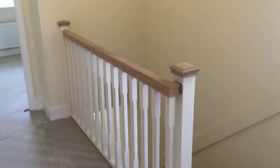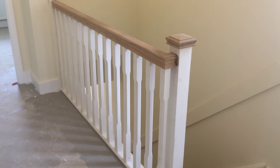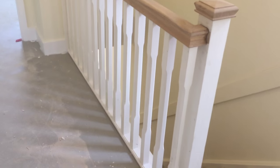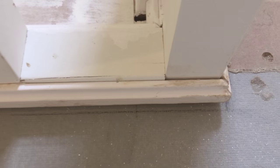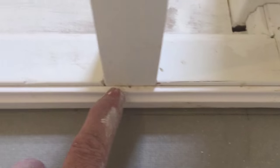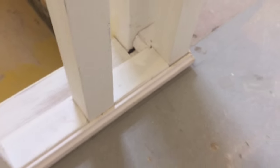Right guys, here's a typical stairs I've got to do — I've got to varnish that rail and undercoat and gloss. Now the advantage is that a lot of the stairs in new properties come pre-primed, so they've already got a decent coat of white on them. Let me give you a bit of an example on the tracking — see that little gap there? Little gaps. This one's not that bad, but you do see the gap — normally you need to gun that up. You can see more gaps here, especially further along, so this acrylic primer undercoat will fill them gaps.